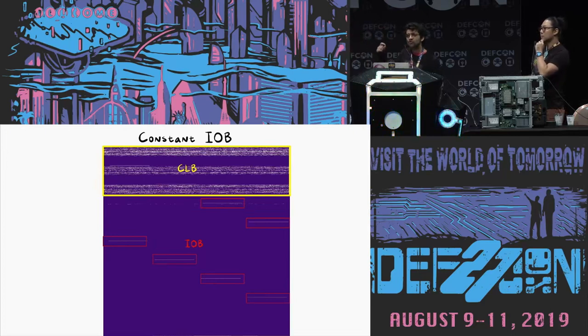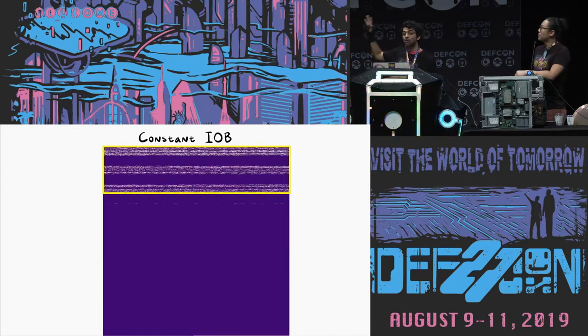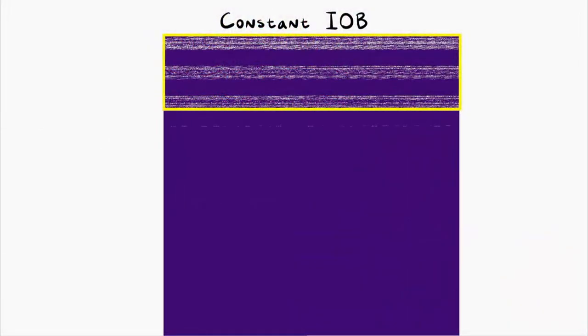If you change a little bit in this, like a byte here, you can change the value of the logic of the IOB from 0 to 1 or 1 to 0. These 8 bytes represent the characteristics of this IOB, so you can convert it from input to output by just changing one parameter. By changing just one parameter, the number of rounds in the SHA-256, look at the logic changing, but the IOB remains the same. And this is the diff. The only diff was actually in the complex logic block. It was not there in the IOB. And this is very important.